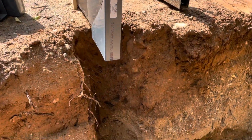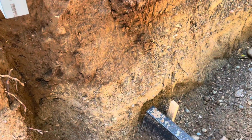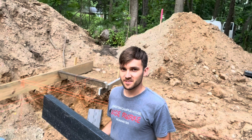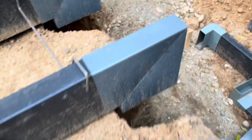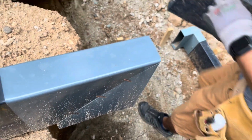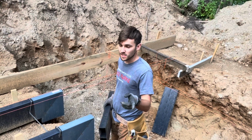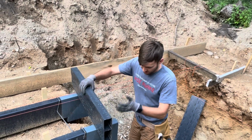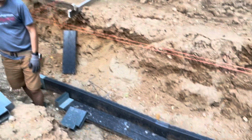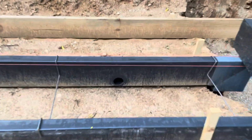Since this trench from Thursday is still holding up, I'm going to start working on the other three for our vertical sections. So, here we are. Today's Monday and the cement gets poured Thursday, and we have an inspection Wednesday, so got a lot to button up in a couple days. Still have to finish the vertical parts of the step footer and set these elevations on that, and set the rebar in place.